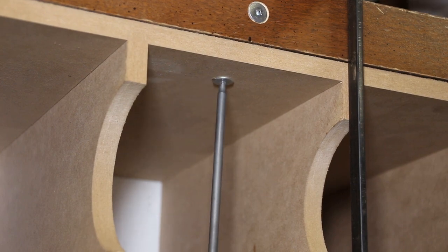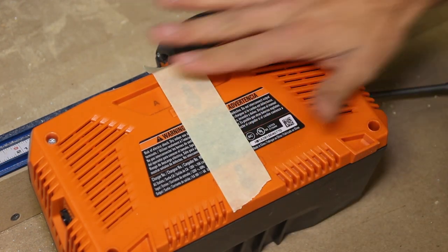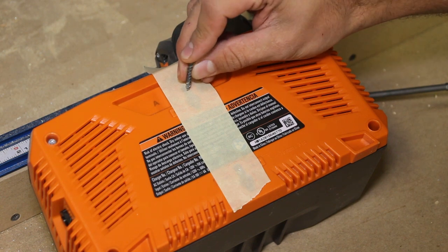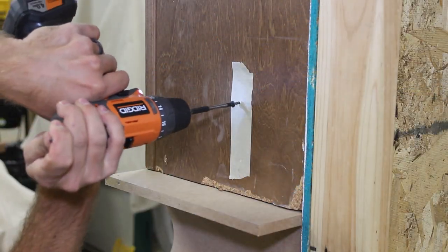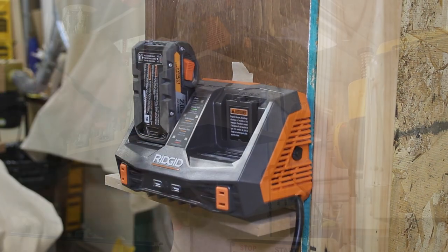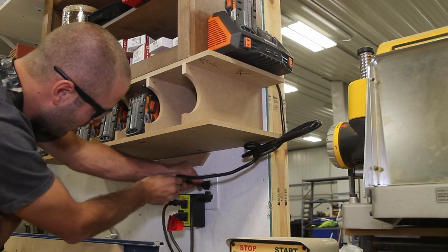Here is a handy little trick when mounting chargers. Use a piece of tape and place it over the mounting holes. Using your screw, make a small hole where each screw should go. Remove the tape and place it on the surface where you will be mounting it. You will drill a pilot hole or just drive the screw where you made the holes in the tape. They will align perfectly to the mounting holes on the charger — no measuring or fussing around with spacers.